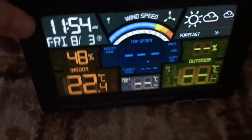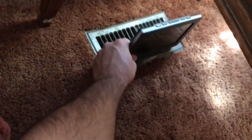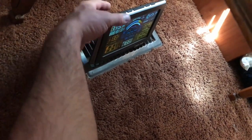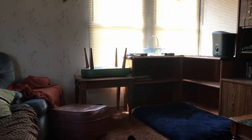22.4 is the intake air. Now I'm going to go stick this on a vent — oh, that vent's nice and cold. I normally want anywhere from 15 to 20 degrees difference in Fahrenheit. I'll stick the thermometer on this vent here for about 15 to 20 minutes and see what it's at. I wonder if I should put a cardboard box over it so the sun doesn't beat down on it and screw it up.